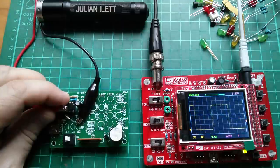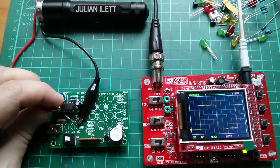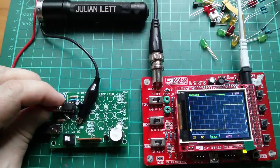I can probably go one more stage. The next pin is pin 5 for Q5. That took a little while to be actioned, but that's a lower frequency. I'm going to have to slow down the scope timebase — one second per division now — so we get to see that at a reasonable rate.